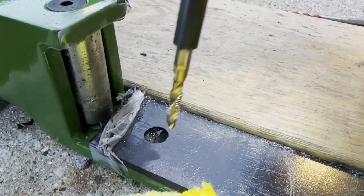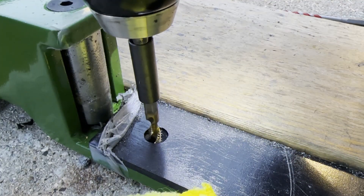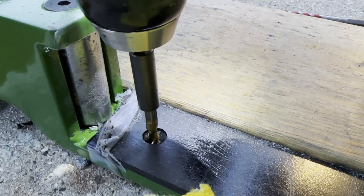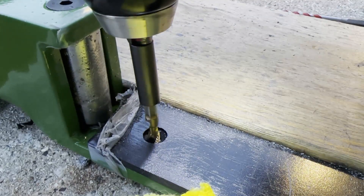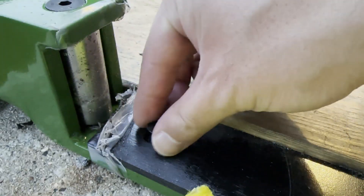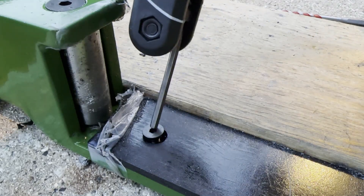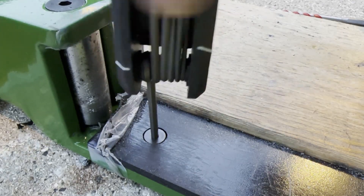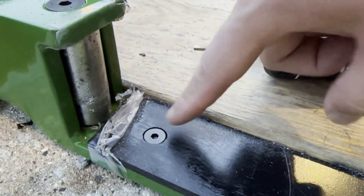You want to take the tap drill bit, put a little tap fluid in there, and go nice and slow through the metal. As you can see I take my time with this — this is in real time — going through nice and slow, making sure it's nice and secure as I am making the grooves for the screw. Once you get to a stop, you want to go through backwards at the same speed you went through, nice and slow, and it will make that nice tap for you. If you do it successfully you should be able to insert your screw and it should bite down after you start going through with your Allen wrench. After installing the screw it's nice and flush, or a little bit recessed in, so there's no metal on metal contact.